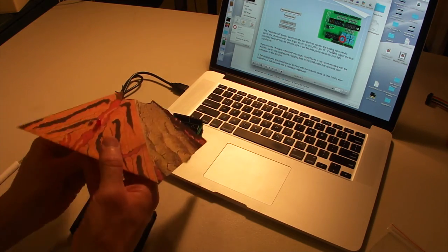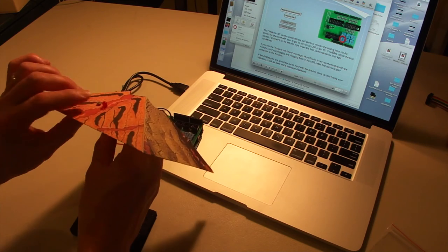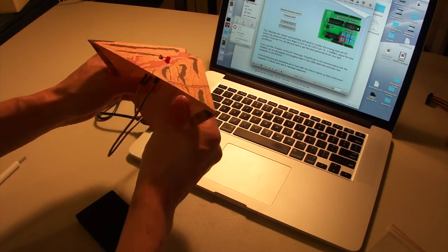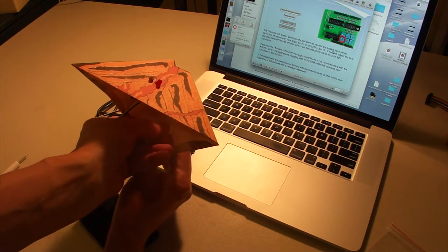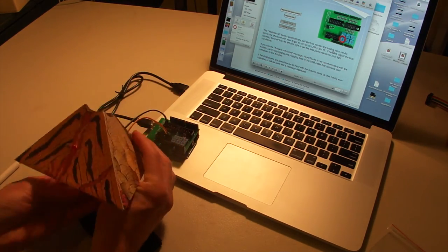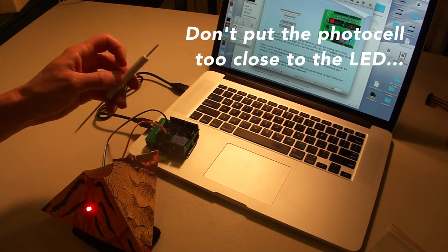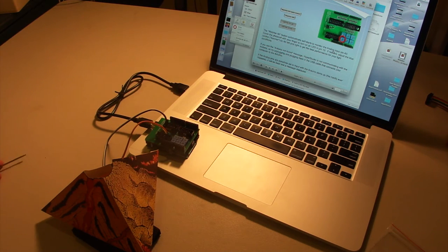You can see the LED is blinking like crazy — it's all wired up. It looks like I need to actually adjust the potentiometer, so let's just tape this together using a little bit of tape for the tab. We'll tape it all up and stand it up. You can see it's just blinking like crazy because the photo cell is right next to the LED. So I'll use the screwdriver and adjust the blue variable resistor until the LED turns off.